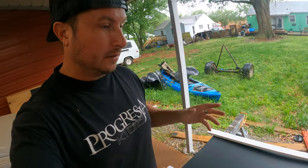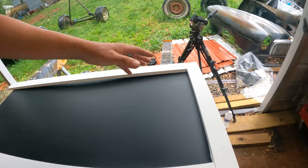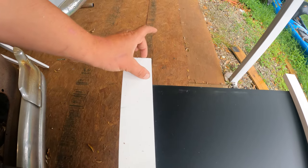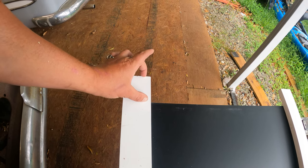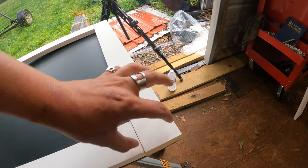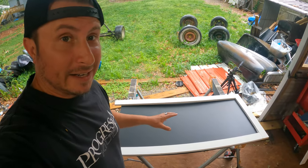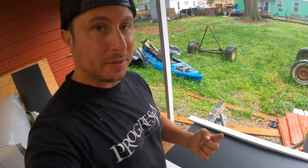So we started with a two-foot by four-foot chalkboard piece from Home Depot. We ran a piece all the way across the top and we're running our side pieces down under that. Single piece cut in half leaves us about two-and-a-half inches of little bitty stubby cute legs — and that is because we ran the top piece all the way across. So we're using this width to push everything down to give us these cute little legs. Now it's time to go ahead and attach these guys, which I'm going to do exactly the same way: glue bottle, couple screws in from the back.